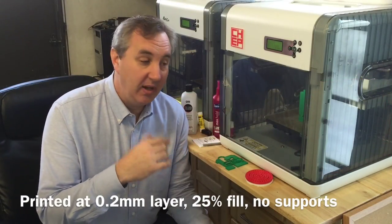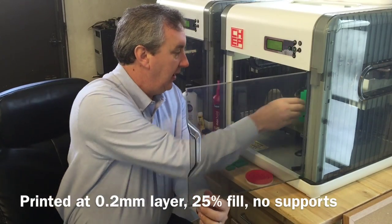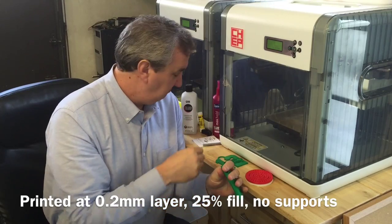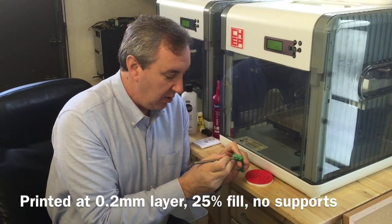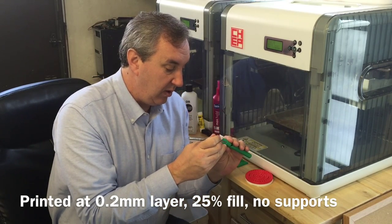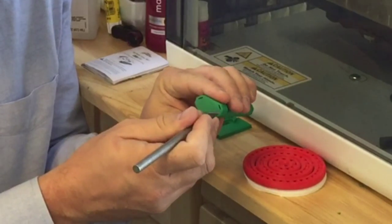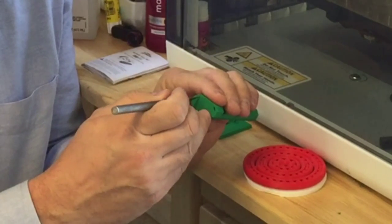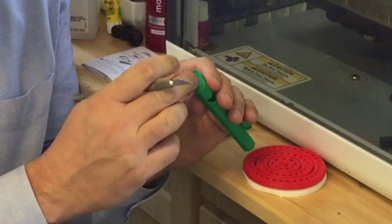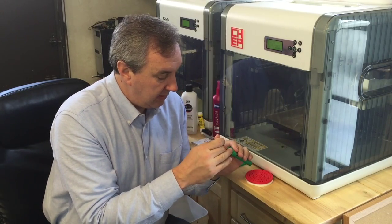I printed this one at night so I didn't put a time-lapse on it — not a big deal. The print is finished and it comes off real easy. It looks like the bottom just needs a little bit of cleanup on these holes here, because I had it set to smoosh down so it held its place. So all I do is take an exacto knife and just scrape away at that first layer that got smooshed down. Not much to take off. So that's cleaned up.